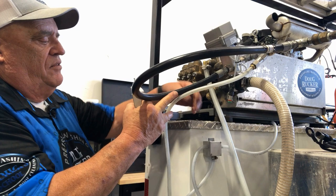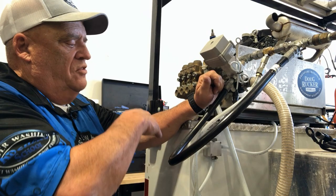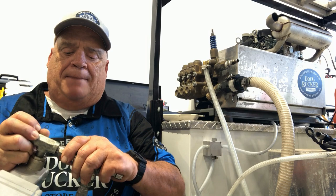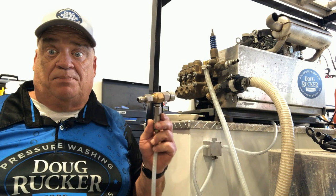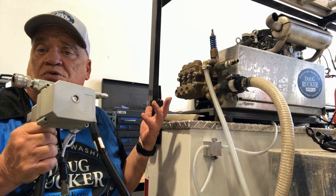The last thing I do before taking my injector off is turn the valve lever to the middle. That will stop any type of bleach or water from continuing to be siphoned through the injector hose, because I'm going to take my whip hose off, take my Flow Pro remote system off the machine, and put it in the back seat of my truck — I don't leave mine permanently mounted, I always take it off. Keeping it in the middle stops the flow, because you could still have a vacuum where bleach or water could come out and leak all over the place — especially the bleach. So I always return this to the middle portion of the valve to stop that.